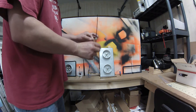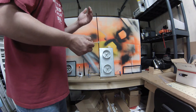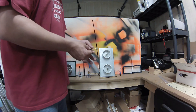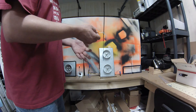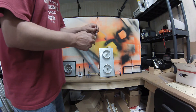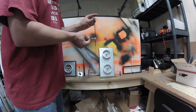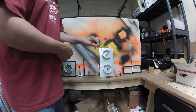That brings us to the dipole for the LRS systems. It is also a linear polarized antenna — works best when mounted vertical. It has a ground plane, so it has a top and a bottom. Typically, if you get these stocked from Range Link, Dragon Link, Thomas Scherer, or Chain Link, the coax will run almost parallel to the ground plane for about 10 to 12 millimeters, or up to a half inch. That's how you identify the top and the bottom of this antenna. It is not meant to be mounted horizontal — it is meant to be mounted vertical.